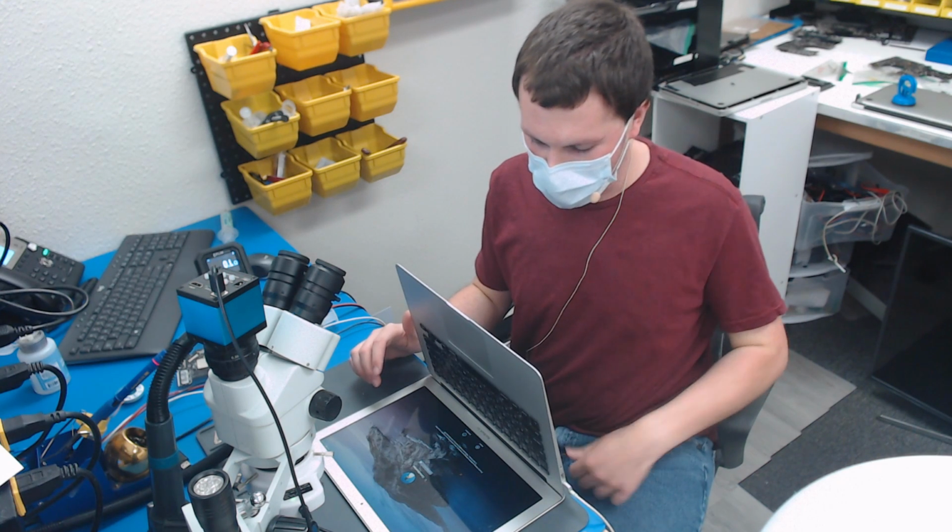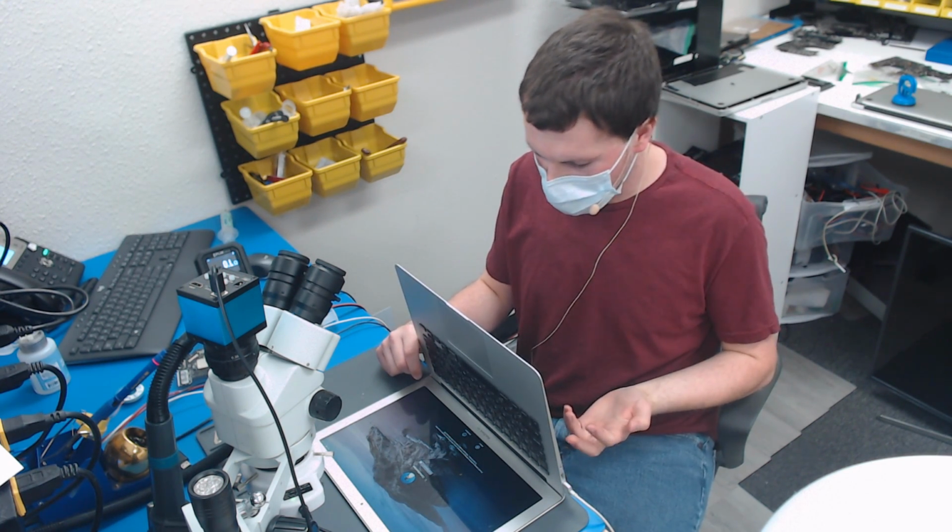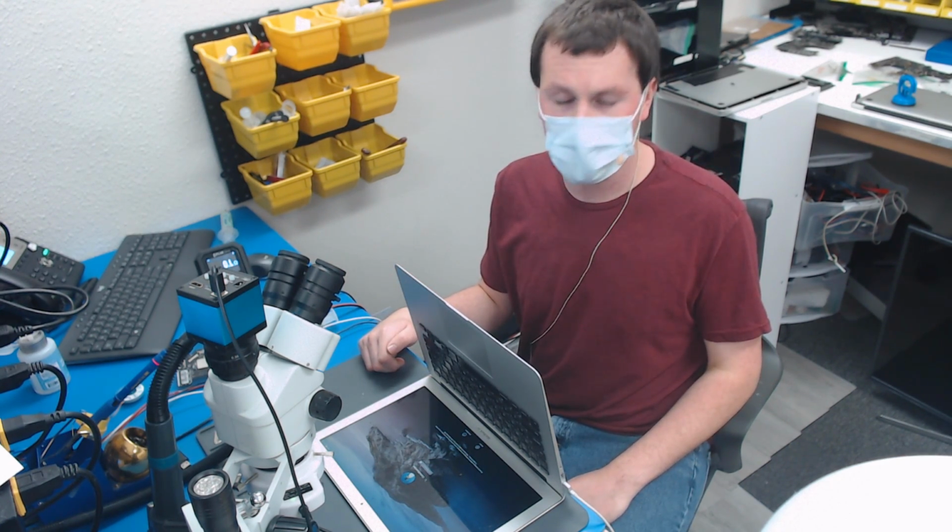To review, we had a short on PP-Bus G3 hot that was caused by a tantalum capacitor. Replaced it, replaced the blown fuse on PP-Bus G3 hot, and this is fixed. So hope this helps you solve your problem.